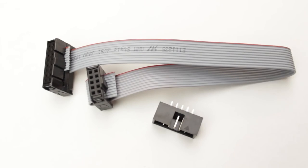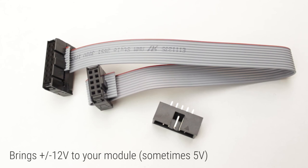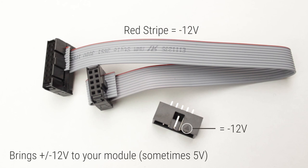The power connector is what we use to transfer power from our system's power bus to the module. The connector on your power bus will be a male 2x8 IDC connector, and on your module usually a 2x5, although you'll sometimes require a 2x8 IDC on the module side if the module also requires 5V. Something really important to observe is the red stripe on one side of the cable — this identifies the minus 12V rail, and you must connect this the correct way around on both your module and the power bus to prevent damage. The small triangle you can see should match with the small triangle or the minus 12V marking on the silkscreen of your PCB. Always triple check your connections, especially when installing a module for the first time or soldering a power connector.